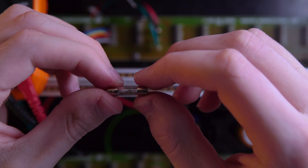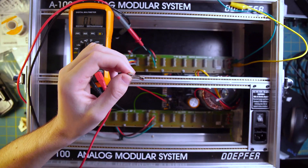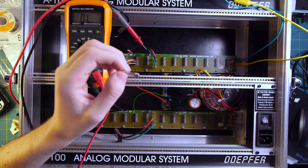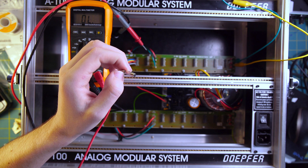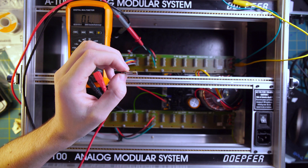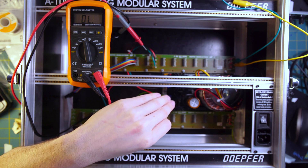There's no current passing through that fuse at all. It wasn't the fuse on the board — it's the fuse on the power connector. My guess right now is that this fuse has simply gone bad due to old age, not due to an issue with current draw. However, before I replace it and switch the whole thing back on, I want to do a little more checking to make sure nothing is wrong and it wasn't blown due to the new power supply drawing too much current or some sort of short circuit.